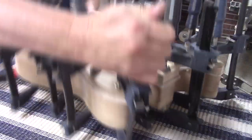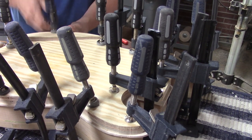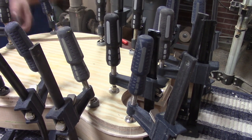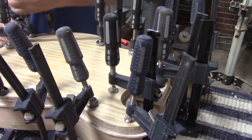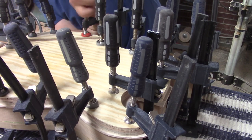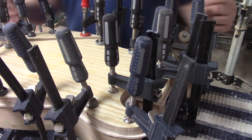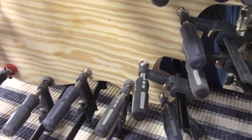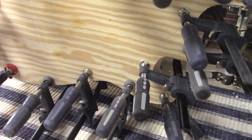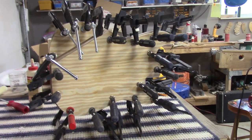Okay, so that's everything that's flat. Now we're going to bend this bendy bit. I'm going to use this leftover hunk here — we're going to use it exactly like we did the other clamping caul, only it's going to flex a little bit. Going all the way around with our clamps. That looks pretty decent. As you're doing this, go around and make sure you've got squeeze out all the way around. If you've got some places where you don't, readjust your clamps, add another clamp. We've got a whole boatload of clamps on this thing, with nice squeeze out everywhere.